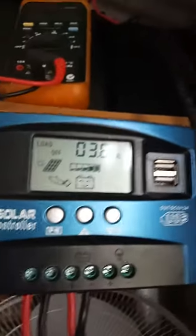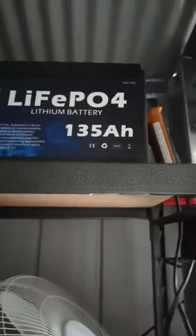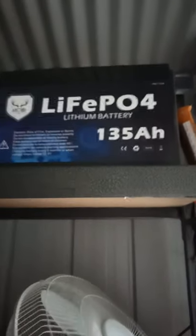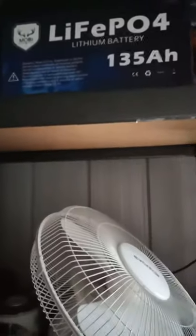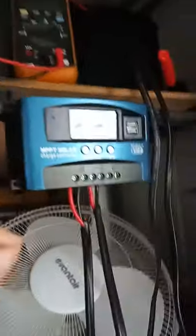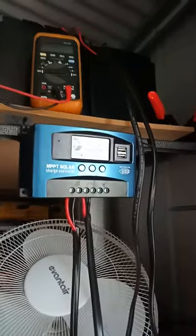So I'll be adding extra cooling. What I'm trying to do is find out what these batteries actually are — are they genuinely 135 amp-hours, or are they just 80 amp-hours with a 135 amp-hour sticker on them? Currently I've got about one and a half kilowatt-hours stored out of them. But because of this MPPT overheating and not charging the batteries fully, I don't really know how much power I've got there.